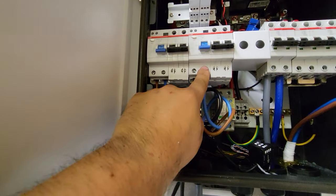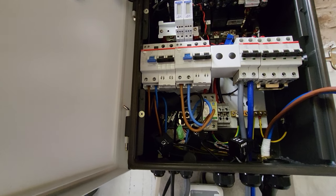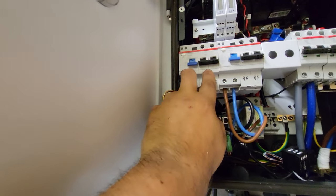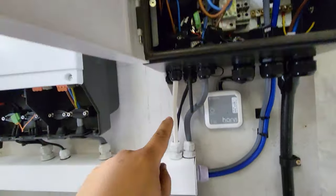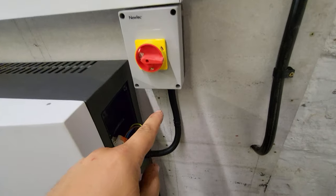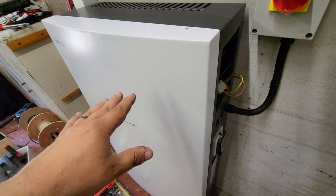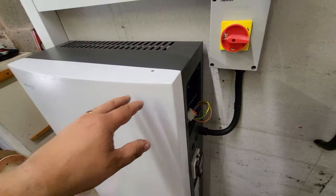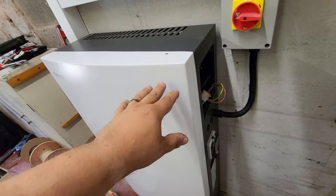So this first one is for your PV and it's the AC input. There's no MPPT and DC strings coming in here, it just connects via AC. This one on this side is exactly the same. So again, you've got your RCD and your C32, but that drops down through this AC isolator and into the GivEnergy all-in-one battery system. Now again, this is AC coupled, so it's just feeding AC between itself and the gateway. So this can work as an independent item.